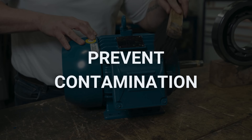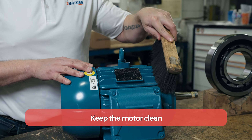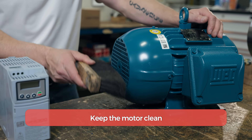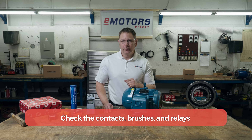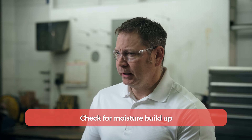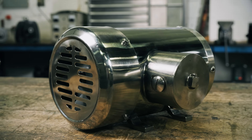A lot of motors come into contact with dirt, particle debris, or moisture. These contaminants can interfere with the cooling of a motor and damage its bearings. It's important to know how to clean your electric motor without damaging the internals. Ensure the ventilation ports and fans are clean. Use a brush or compressed air to clean the outside of the motor regularly. Check contacts and relays and clean them if you notice any contamination or corrosion. Keep motors free of moisture — moisture can lead to corrosion that damages the motor windings, bearings, and electrical connections. The exception is wash-down motors, which are built to protect the motor from a degree of moisture.